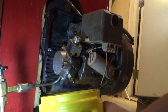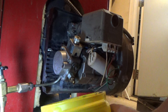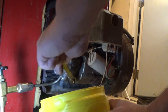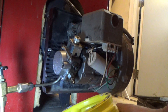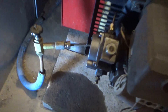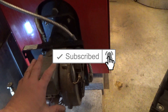It may take a couple of times for you to get a solid stream of fuel, but I think we got it here with the first time. We're just going to check for leaks real quick because I did have this pump cover off — I think we're good. That's pretty much all there is to it. I'm just going to slip the burner cover back on, which will quiet this down a lot.